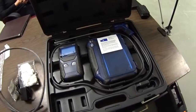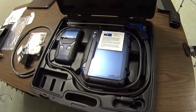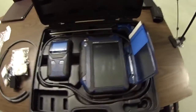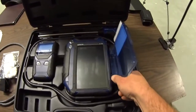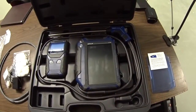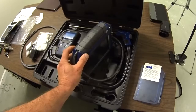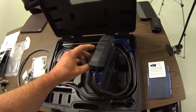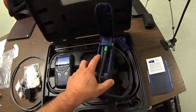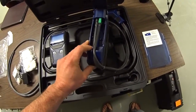A length of hose to tie into the device, and the star of the show is the A550L itself. You've got a cover that protects the large touchscreen. The cover can be removed — just pop it out of the little clips and you have access to the screen without any obstruction in the way. The design is very modular in that you can change your accessories pretty easily. To get to the probe connections, you pop the side open, lift it up, and you've got two connections: one is a K-type thermocouple connection and then there's a hose connection for the pump. This section of the device is spring-loaded to allow you to open and close and lock it down.